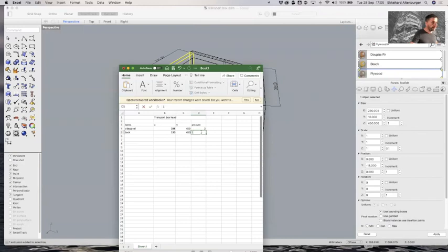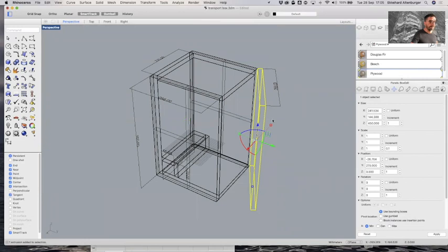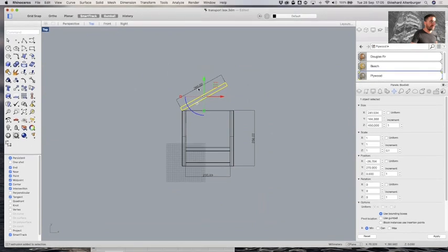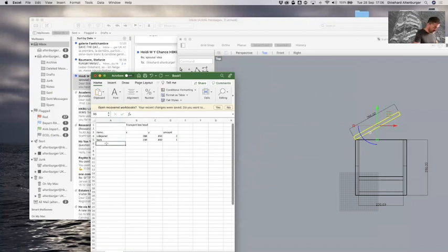We only need one. And then we've got the front. Now, be careful with this because this is the size in X and Y dimension. It measures from the space it inherits, so you have to be careful. Here I would go with the aligned dimensions. The front is the 266, and I know it's also 450.